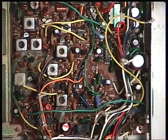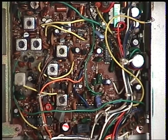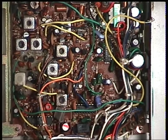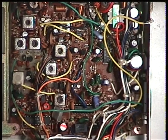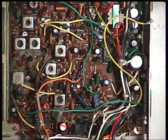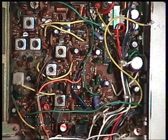I'm back having sorted out the no-transmit problem. For some bizarre reason, the transmit line went to that filter switch and then no further. We'll be reinstating the filter - which is a bit of a tone control - later on, because the capacitor and wiring needs putting back on. The transmit line wire went down there, and that's now got us back into transmitting.